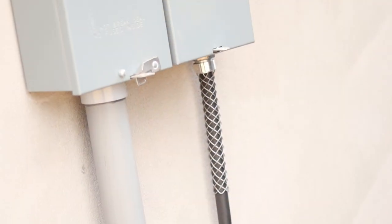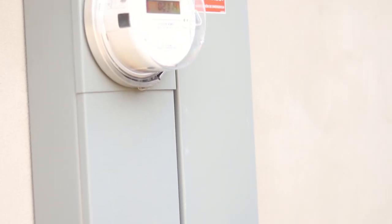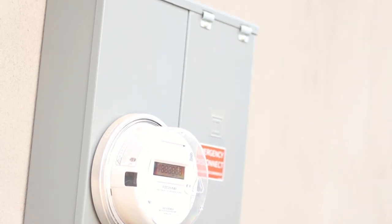So regarding the 100 amps, that's just how they identify the panel when you go to buy it. I am not powering the trailer with a 100 amp service. That is very typical of an entire house back in the day. So you don't need 100 amps to power this thing. It's actually running off a 2-pole 50. So I actually have a 50 amp service and an appropriately sized 50 amp cord feeding the panel that goes right out the bottom of the trailer floor. And that allows me to plug into shore power just about anywhere with the space in the panel I need to plug into.